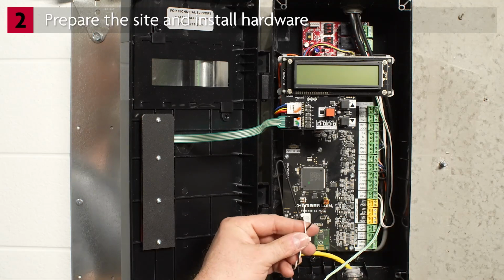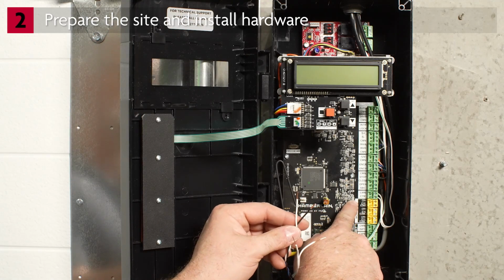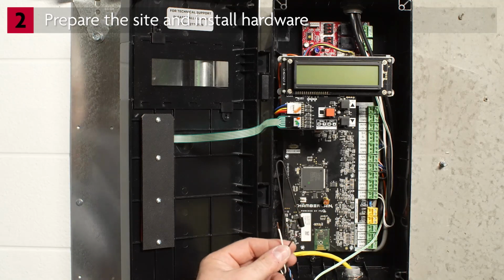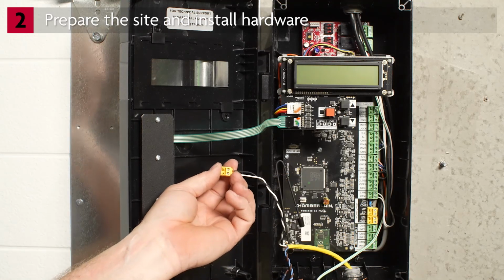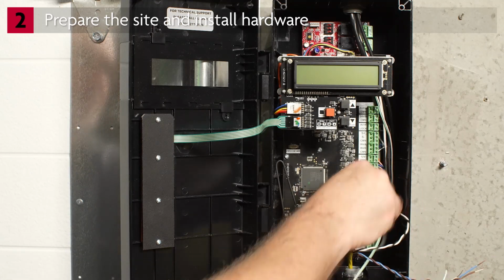To wire the light curtain, remove the terminal block from Monitored. There are terminal blocks for connecting 3 monitored devices. Remove the top terminal block for iEdge1. Connect white to common. Connect black to iEdge. Reconnect the terminal block.